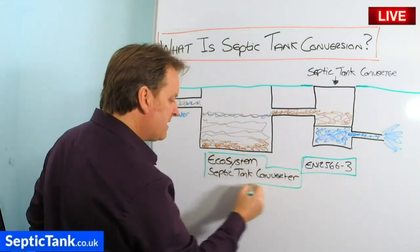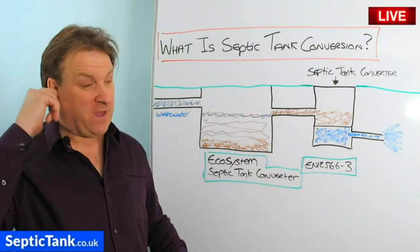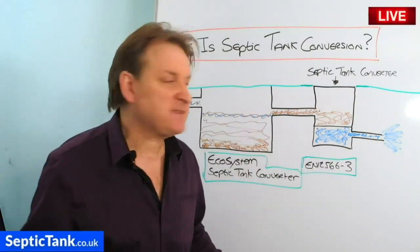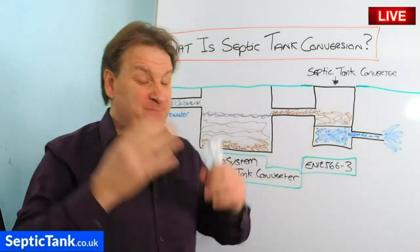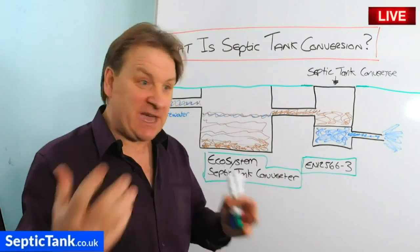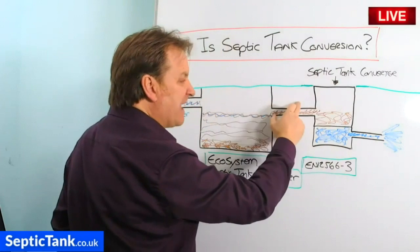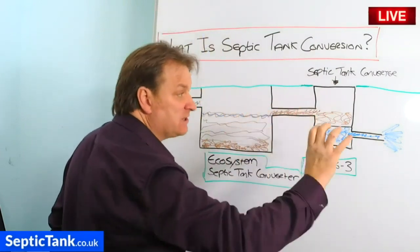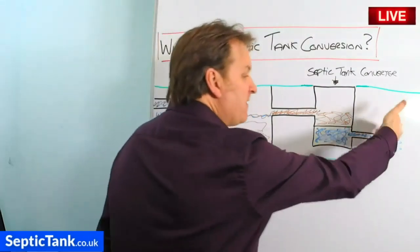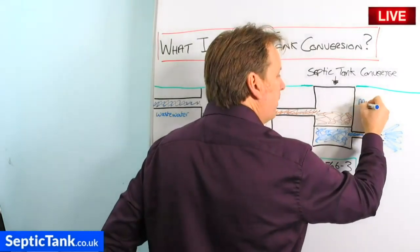Yeah, that's right. And why they're so good is, right, because as I said, if you haven't got a septic tank converter and you're selling your house and the government inspectors are coming around, you just put one of these in because you don't need any special knowledge with it. And you just get a dig. It takes 40 minutes to dig the hole. You plonk it in. This is standard 4-inch pipe in, just slots into it straight from your septic tank. Standard 4-inch out. And that mineral water, that clean, clean mineral water can go anywhere.